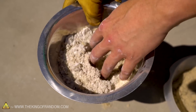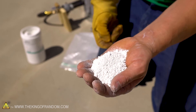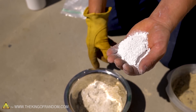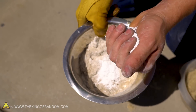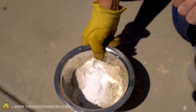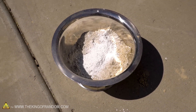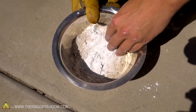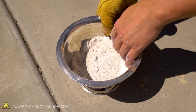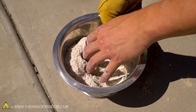There's one more ingredient we're missing — that's the lime. This is actually hydrated lime, or calcium hydroxide, which is what happens when you add calcium oxide to water. This will be the lime part of our soda lime glass. We're probably not going to add very much, as it will raise the melting point but increase the chemical resistance of the glass and make it insoluble in water. Just a few percent in there — it won't be the best drinking cup glass, but it'll probably look pretty good for a window.